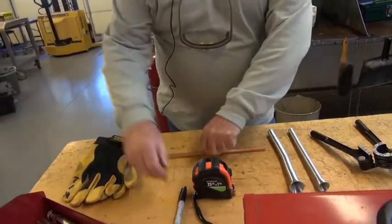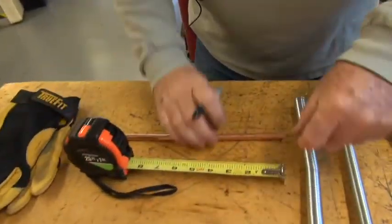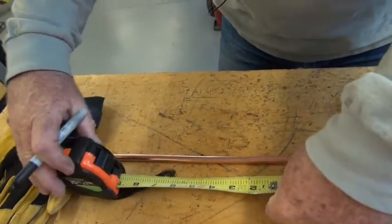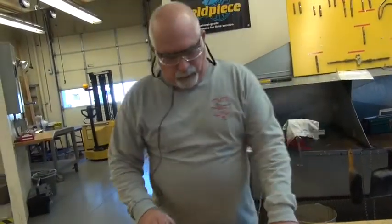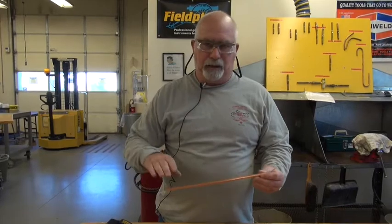Put your glasses on and open your tape measure. Mark two inches, then mark seven inches from that — making it nine inches total — or just move the tape measure to seven. Now your points are marked. We're going to bend the 45 first, then the 90, and then flatten it back out for the tube bender. The markings stay on there even if the pipe doesn't come out exactly straight.